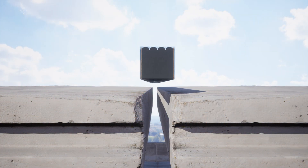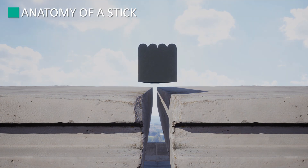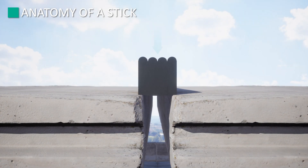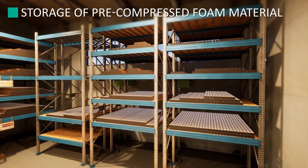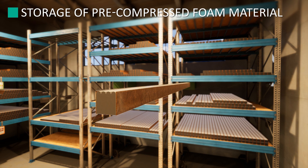Before we start, a word of caution. It is very important not to open any sticks until you're ready to install. Once the shrink wrapping is removed, the stick will start to expand. If the foam strip is opened early, installation can be difficult. Temperature, humidity, storage temperature, and direct sun exposure play a key role in the expansion time of the pre-compressed foam. For better handling in warm weather, store in a cool place for up to 24 hours prior to installation to slow the expansion down. Average expansion time is approximately 2–5 minutes, depending on environmental and pre-installation storage conditions. Products kept in a warm area and exposed to sun will expand faster than products stored in a cool shaded area.